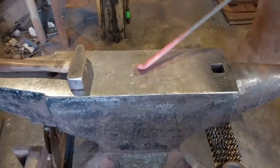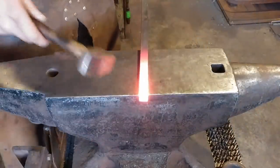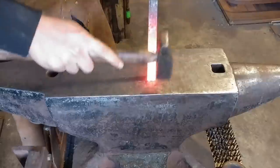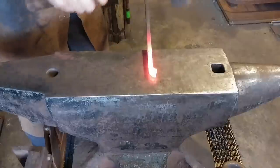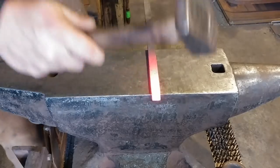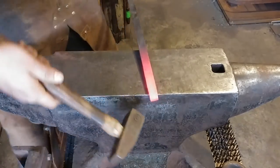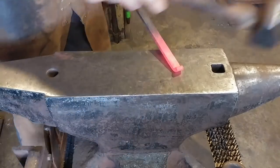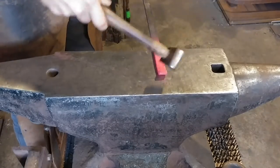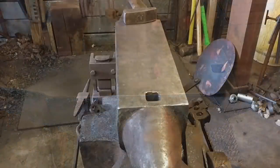So that's what we have so far. We'll take another heat on it and continue to knock off the corners and get ready to roll this on up. Nothing really difficult here — we're just trying to dress off this little nub on the end and get it to where it's nice and smooth and even. You'll see why this is important because we're going to roll this up.